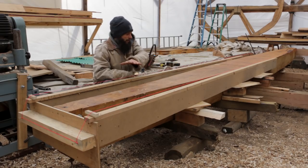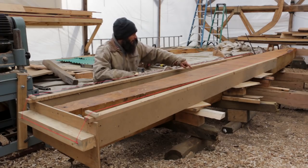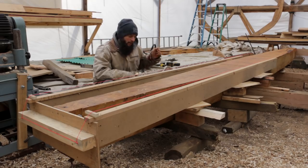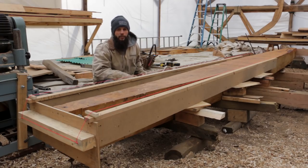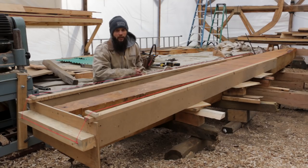I slid the router down on the sled and used the bit to check our depth. As we got down to that dip we were about an eighth of an inch above it, so I dropped the router down that little bit to make sure we'll hit that lowest spot. Then we'll work our way back and rip it all off. Once this side's done I'll flop the rails to the other side and repeat the process. We'll do the same for the ballast keel — that'll give us two flat surfaces that should mate together very well.